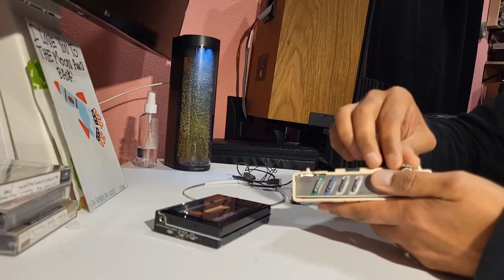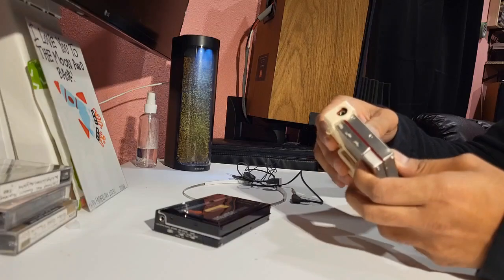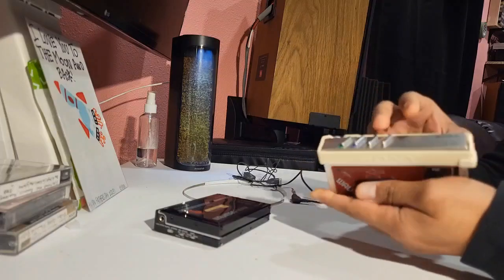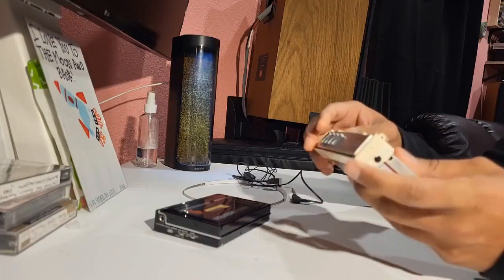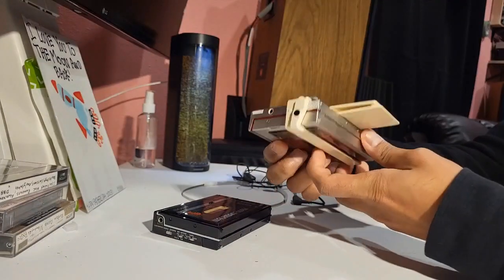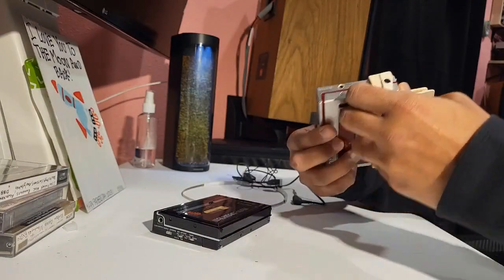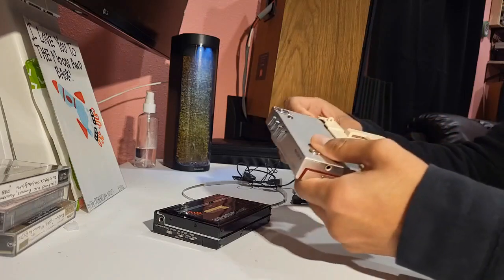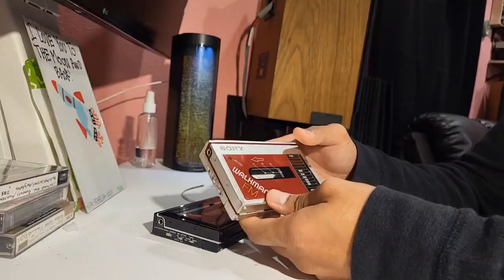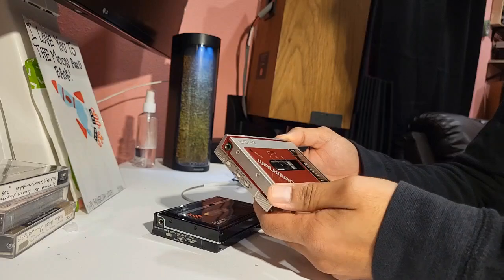So the problem with the red one was it wouldn't play radio. There was corrosion first of all, so you couldn't put a battery in and then test the radio. I had to use a current control DC source to make sure I'm not shorting out something and damaging it. So once I fixed everything up, I put a new belt in it.